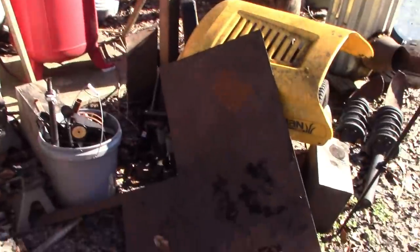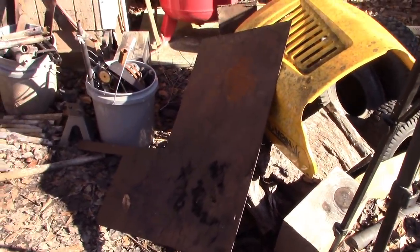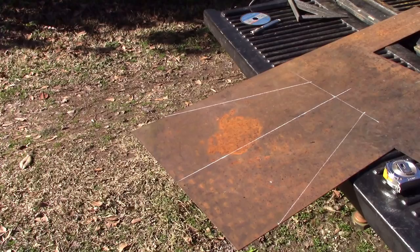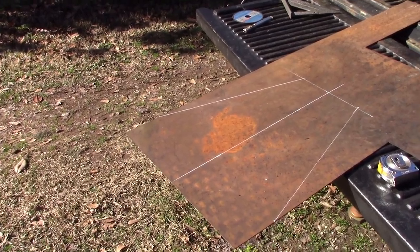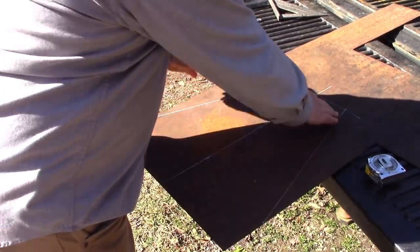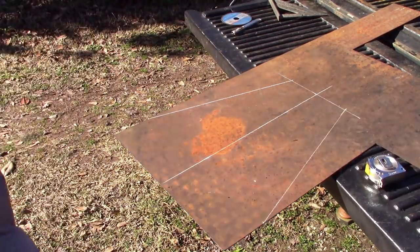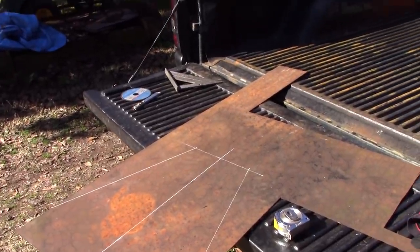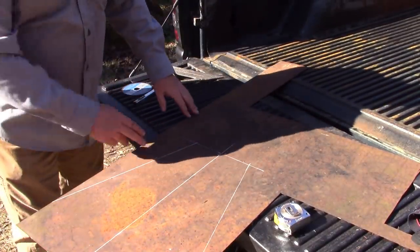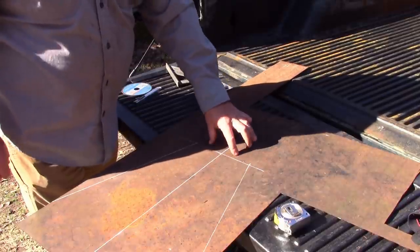I'm going to take this piece here — it's just an old piece of sheet steel I had, 16 gauge — it'll work for this. I've got my metal marked out for the back plate. Over in this area I'm going to start cutting my two-inch strips. I'll be cutting them to go all the way around this thing, at the top and down here, all except for the bottom where my blower will be.